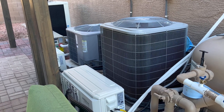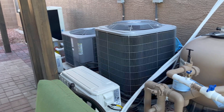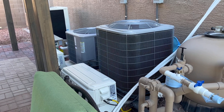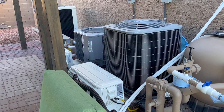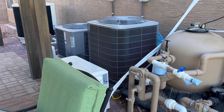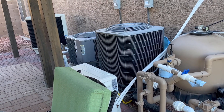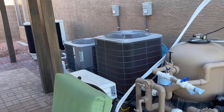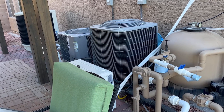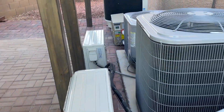We're producing plenty of power to run this. I just got a 12 kilowatt off-grid inverter that surges to 36 kilowatts, but I have to restring all my panels because it's only 150 volts on each MPPT charge controller. The lady at Signature Solar said I could hook up 9,000 watts on two separate strings — 18,000 watts total — as long as I keep it at 150 volts per string. I'll probably hook up around 7,000 watts and keep it around 135 to 140 volts so I don't surpass 150.